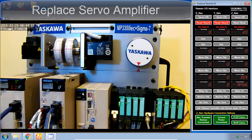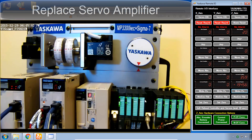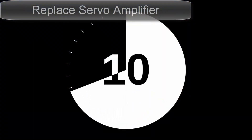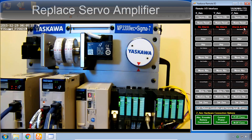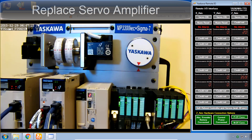Now this amplifier has the factory default parameter set. If this amplifier were replaced, the control power would be disconnected — let's reconnect the control power. You see an alarm because this drive does not have the correct parameters. When you replace an amplifier, check the Mechatrolink node address under this cover. We'll reboot the system so we can reconnect these drives to the controller. After reconnecting, it's reading alarm A.CC0 — an absolute encoder-related alarm — because we don't have the correct parameter set. Let's write the parameters to that amplifier and reboot again.